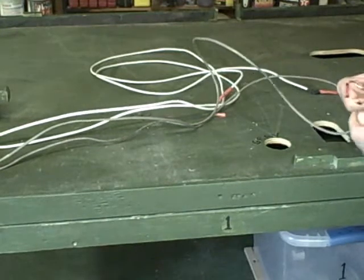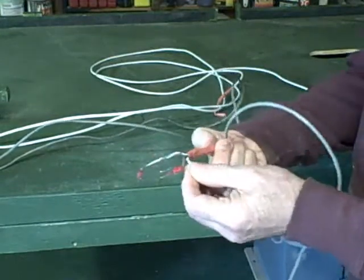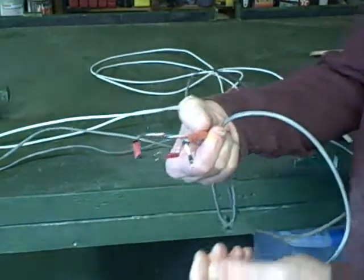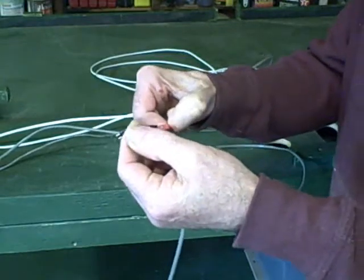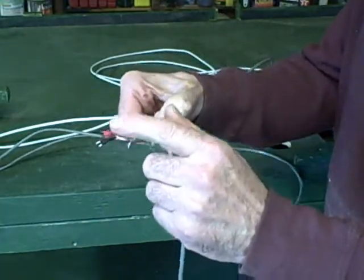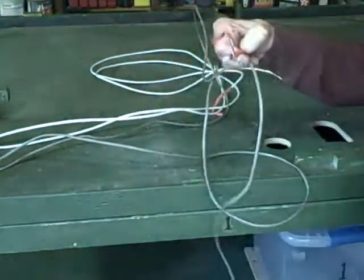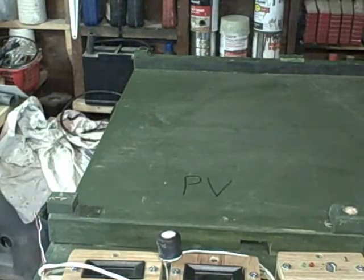Some wires are connected to the relay in the controller — those are the red and green wires, and they'll go directly to the pump. The other cable contains an LM34, a sensor that will convert the temperature directly into voltage, and that will appear on this six-position monitor right here. There's a lot going on, so let's just do one thing at a time.